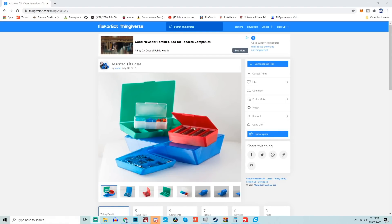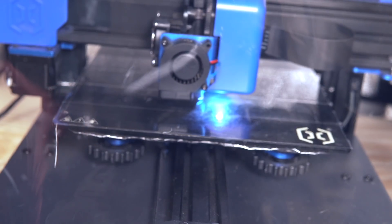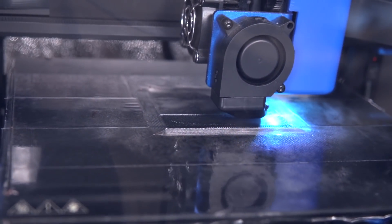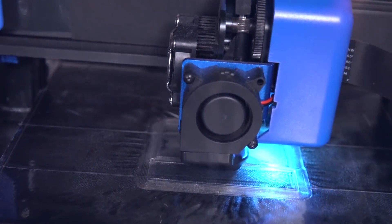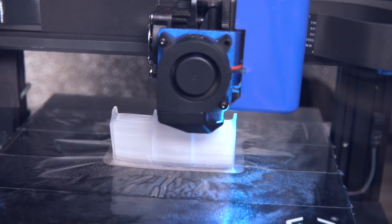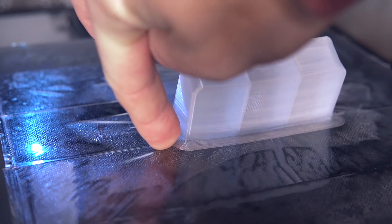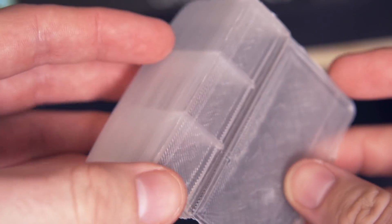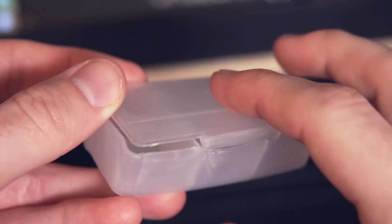One of the unique properties of this filament is that it is really resistant to wear. So I went ahead and hopped over to Thingiverse and found a small three-compartment container with a living hinge lid that just pops on top. I downloaded that into Cura, sliced it, and hit print. The first layer started going down and everything looked great. After a couple of layers, I did notice that the print was actually pulling up — and it wasn't pulling away from the tape, it was actually the tape that was lifting with the part. This is why cleaning the bed is really important and making sure you get all those air pockets out. The tape did at least hold after it went up a little bit, which meant the part warped a bit, but I was still really happy with the end result.